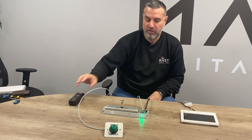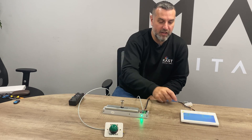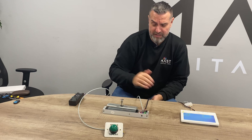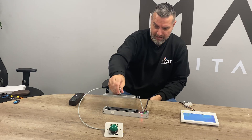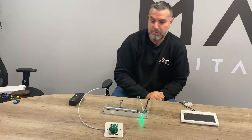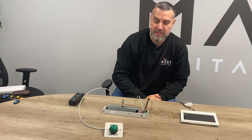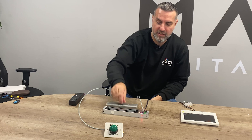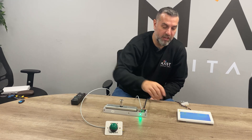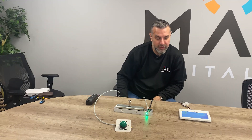Again press the button to call, we can answer the call, we can see who's at the door through the camera, and we can press the unlock button to let them in. Timing is about 10 seconds or so before it locks again — there we are, it's now ready to lock, door now locked again. When our visitor wants to leave they can push the push to exit — again about 10 seconds or so, ready to lock, locked. At any point from the indoor screen we can view that camera and we can press the unlock button again. Unlocked.